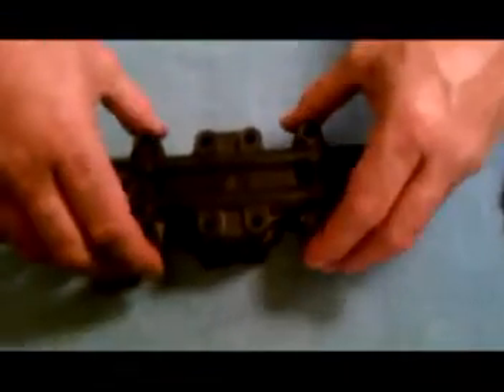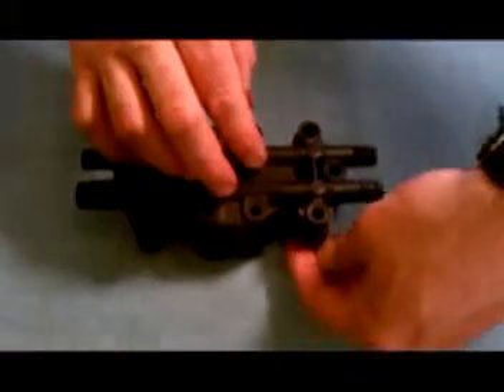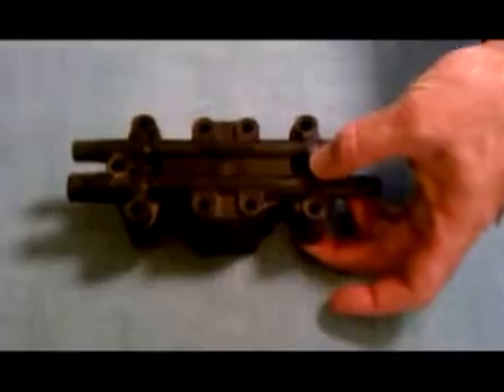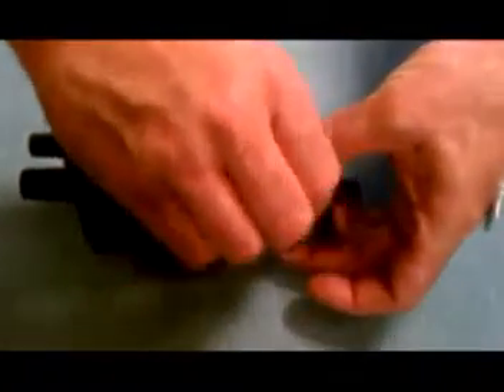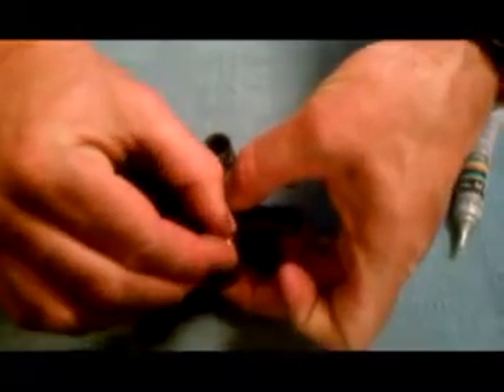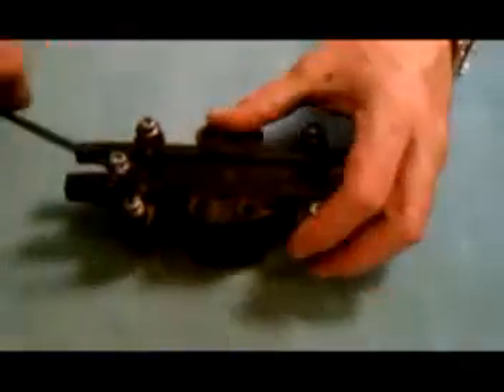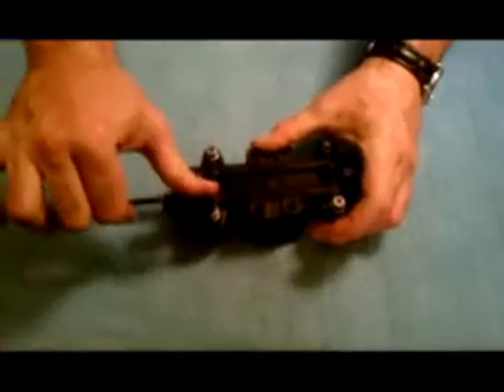Turn your manifold over — you'll see that the pump manifold is marked with in and out on the pump ports. Place your manifold onto your pump head. Place your quarter inch nylock hex nut into the molded area on the bottom side of the pump head and thread your pump bolt into it. Repeat this step for all six bolts. Using your 3/16 inch hex wrench, tighten the bolts firmly. Note that over-tightening the bolts can cause damage to the pump head.